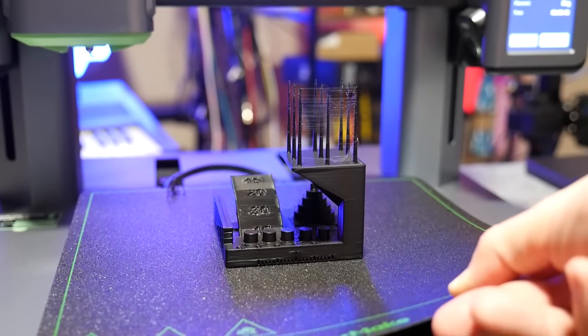The choice of a bed slinger with V-rollers for such a fast machine is also pretty strange. And this whole '5x faster' thing they're promoting — 5x faster compared to what? They seem to label 1x as 50mm per second and 5x as 250mm per second, but it doesn't take into account accelerations. When I tested it against an Ender 3 profile, prints took about half the time of a standard Ender 3 profile — still really good, but a far cry from 1/5th of the time they push hard in their advertising. I also need to talk about the filament retract routine, because it's currently pretty flawed. It simply slowly retracts the filament backwards, which can easily form a plug causing a jam in the PTFE tube. All it needs to do is extrude a bit of filament first before quickly pulling back — next firmware update, pretty please.